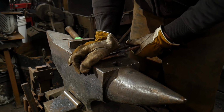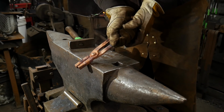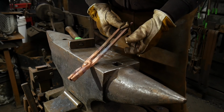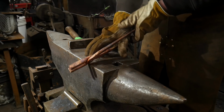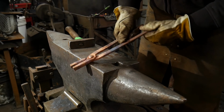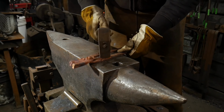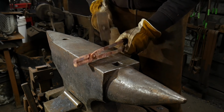And I highly recommend dunking this in some oil to work this back and forth. So your reins have got to harden up, your jaws have got to harden up before you can work this joint open back and forth effectively. They have to work harden somewhat to a degree, so they're going to bend around a bit on you. That's okay. Just keep hardening them up